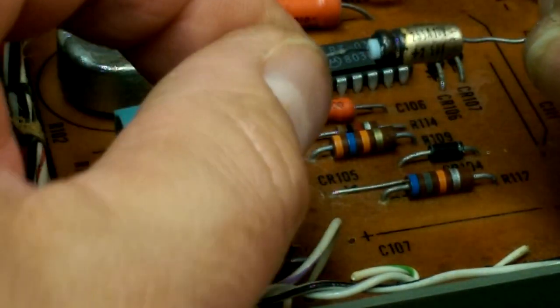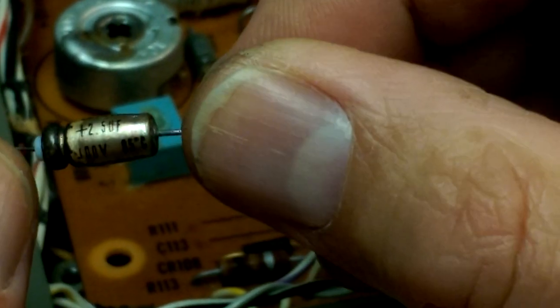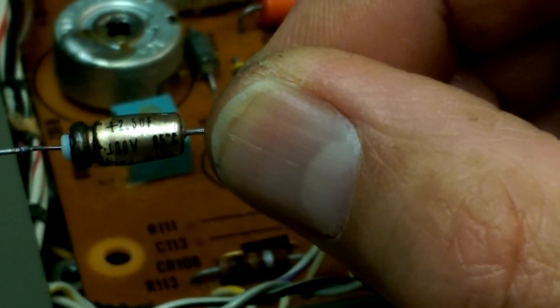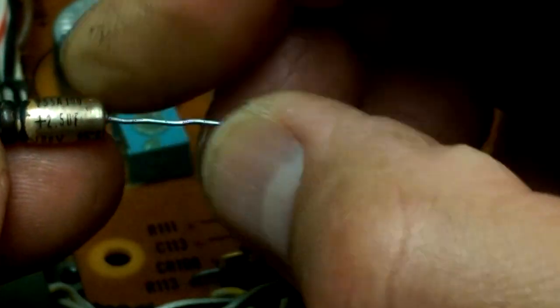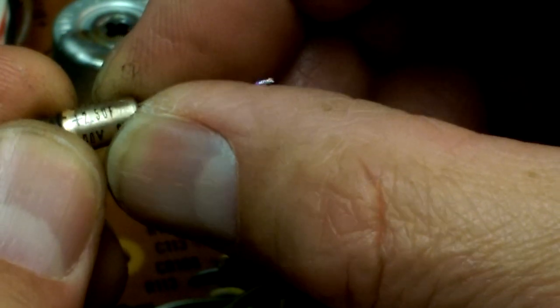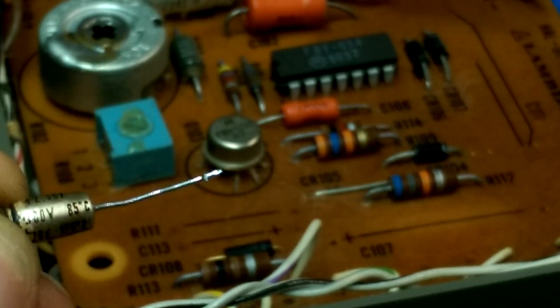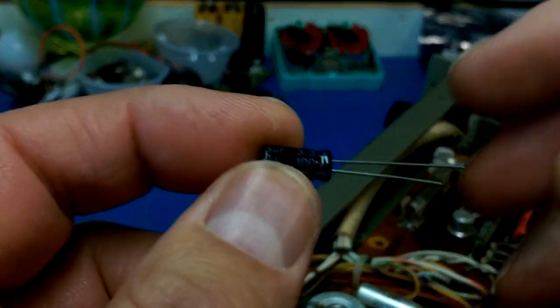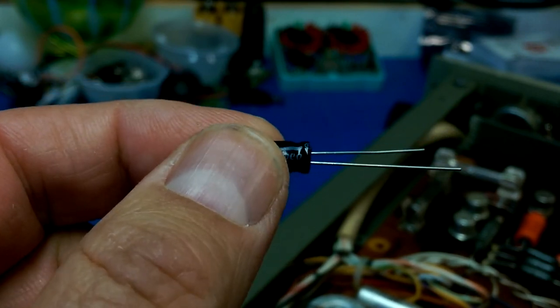Here comes this little capacitor, and it looks like it has seen better days. It's all puffy. There's some confusion between what's labeled on here, which looks like 2.5 microfarads, 100 volts, and what's listed on the parts list. It says it should be 3.3. Oh, lo and behold, I have a 3.3, 100 in my capacitor bin. So let's pop that in, see what happens.